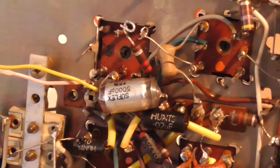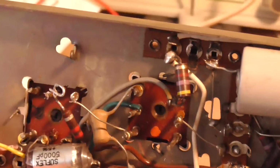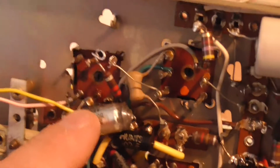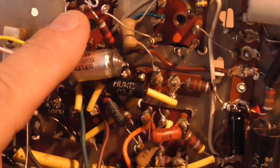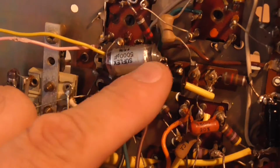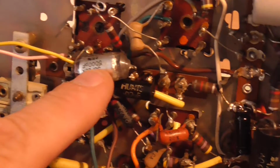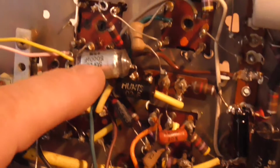Hello there. I've decided to investigate this can here. So I'm just documenting this for myself so I remember where the wires go. A resistor off the middle pin top. Wire link on top pin on the end there. There's a capacitor going across there. We have to be careful because that has got polystyrene inside or it will change value.